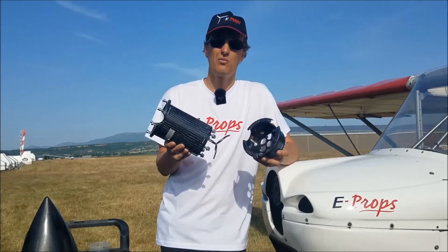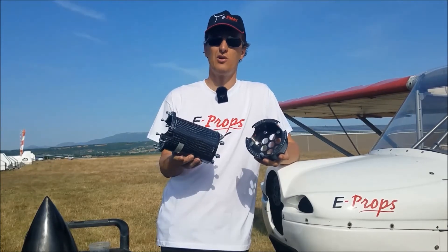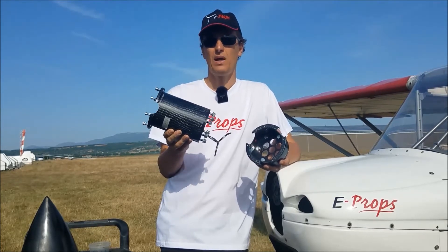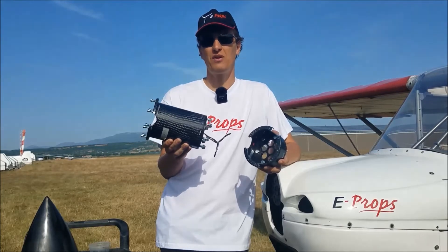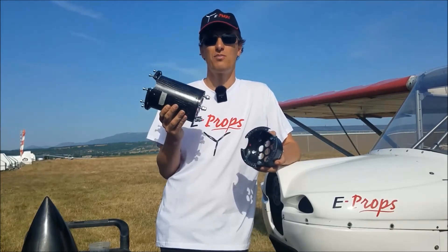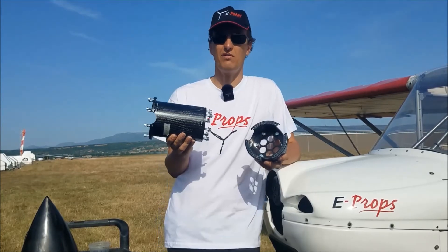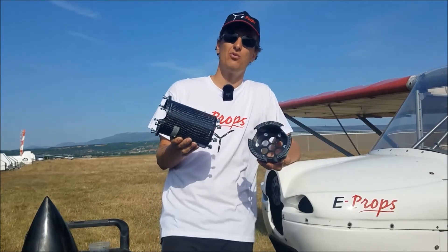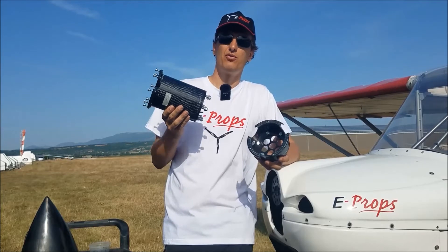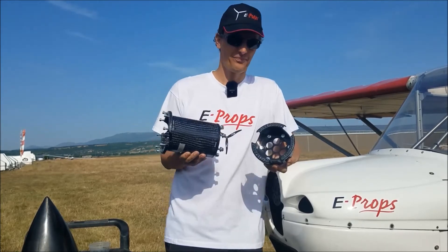What you will have to do is to choose the length. We have 38 lengths in the catalog. The maximum length is 170 millimeters. Please note that the additional mass linked to the spacer function is 1.5 grams per millimeter. So a 100 millimeter spacer increases the mass of the propeller by 150 grams, which is really nothing at all compared to an aluminum spacer, which is near 20 grams per millimeter.